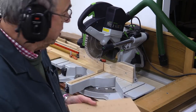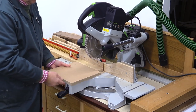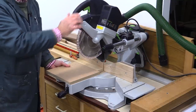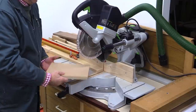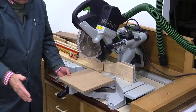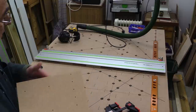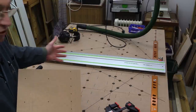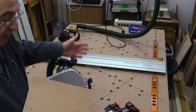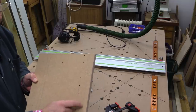Now, what happens if your piece of stock is so wide that the saw blade won't cut to the end? You have to use a different method. You could use this method and then turn the piece around, but your piece of stock may be so wide that even turning it around means there might be a gap in the middle. With the method using a track saw cutting station or MFT3, we've got the guide rail in place. I've got my piece of stock which is already marked with the trench marks.